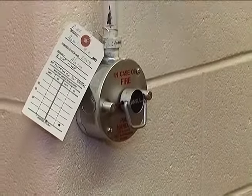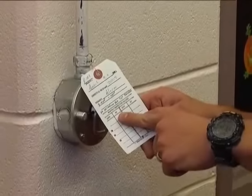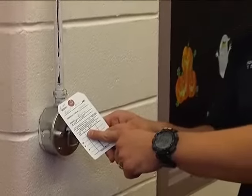This little glass or plastic rod — we also want to make sure there's no damage to the piping and that nothing is piled up in front of it. This is no different than a pull station you'd find on an automatic fire alarm system, so we want to ensure this area is clear and unobstructed. Each month we want to take our inspection tag, flip it over, and record our monthly inspection by dating it and having whoever completed the check initial by that date.